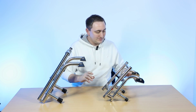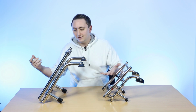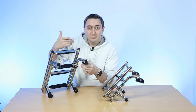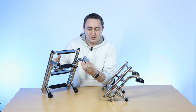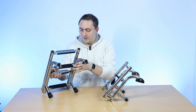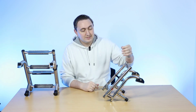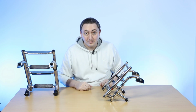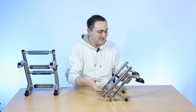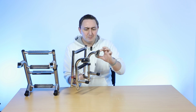One of the first things I notice is the little gudgeons. Ours are pretty standard, I would think, or maybe not if this is standard, but the Whitewater Marine Hardware version has just these nice little gudgeons that have the 2 little screw holes they stick in. They're all good. I was told that this is also 304 stainless steel. I can't review that because I am not going to send this for chemical testing and all of that fun stuff. Their gudgeons are much more like kind of a half moon shape.